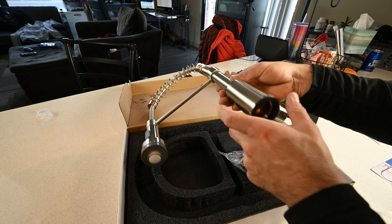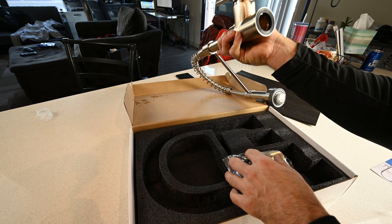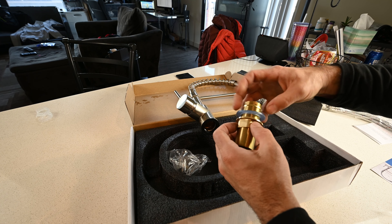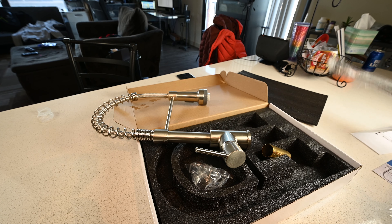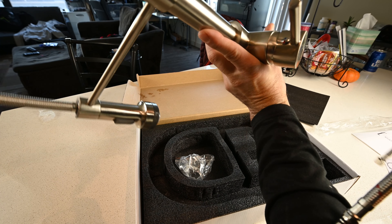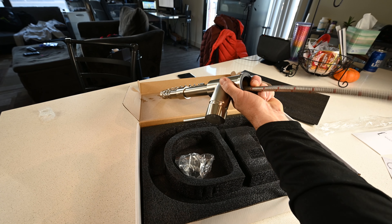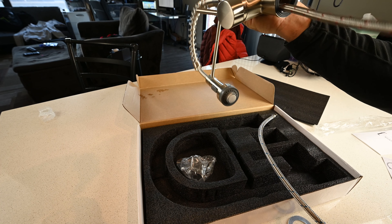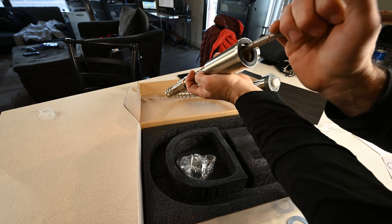We need to prep our faucet. We've got red on the left and blue on the right — so red is going to be hot. There's a little groove here; this is going to go into the bottom. This nut and this washer will go under the sink. We've got our hoses — the hot dot, the red one, goes to the left. The instructions say to put the base on first, but I don't see how that's going to be easier. This just says to hand tighten on — seems sketchy to me, but I'll try and get it as tight as possible. It kind of locks in there pretty good and you got it.